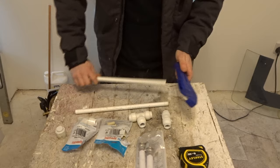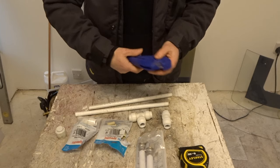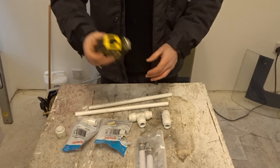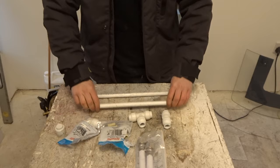Let me show you a few of the tools and bits that you're going to need. You'll need to get yourself some barrier pipe or PEX cutters — they're quite cheap, I'll put a link in the description. Do not use a hacksaw; I don't recommend it at all. Make sure you use these — they're the proper thing for the job. You might also need a tape measure depending on your project, and of course you're going to need barrier pipe and the relevant fittings.